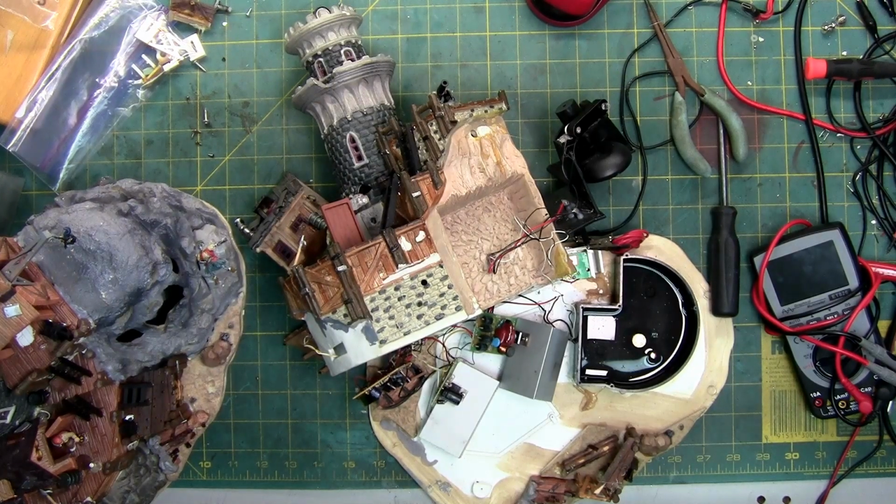Sometimes the electrical issues, if it's an obvious problem like a capacitor, resistor is burned, or a diode, or transistor, they can, in most cases, be replaced without a problem, or even an LED. Those are a dime a dozen. You get hundreds of them for a couple dollars. But if this blob chip is damaged, or is not getting correct signal, or it's not sending correct signal, the house is just going to sit there and hum, and it's because it's not resetting.